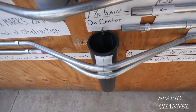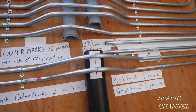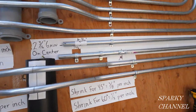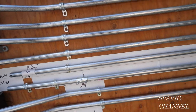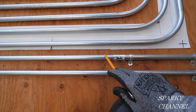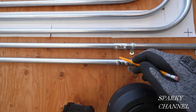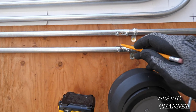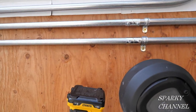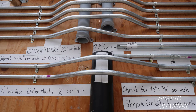Here's the view from the top, and here's the view from the bottom. That's the difference between a 22-45-22 and a 30-60-30 three-point saddle bend. The 22-45-22 used a 71 and a half inch conduit and the 30-60-30 used a 72 inch conduit — both cut before the bends, and both came out just right. The calculated shrinkage amounts were perfect.